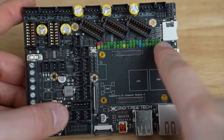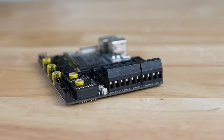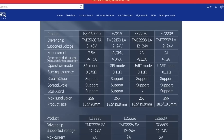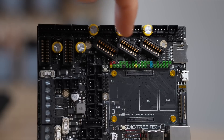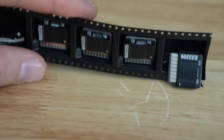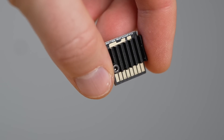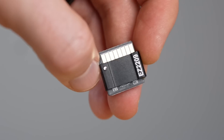You also get access to 40 GPIO pins, giving you a ton of options for connections. For power, you can use a 12 or 24-volt input to power a heated bed and up to two hotends. There's even an additional 12 to 56-volt higher power input if you're running drivers like the 5160 high-voltage drivers. The E3EZ comes with five slots for BigTreeTech's easy stepper motor drivers — they take up less space, don't require heat sinks, only go in one direction, and you don't need to fiddle with jumpers to set SPI or UART mode.